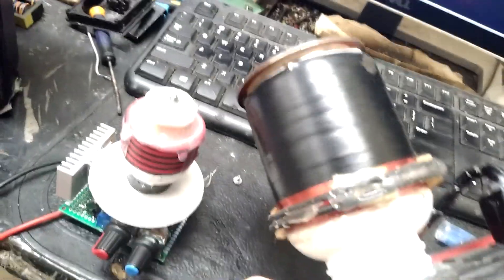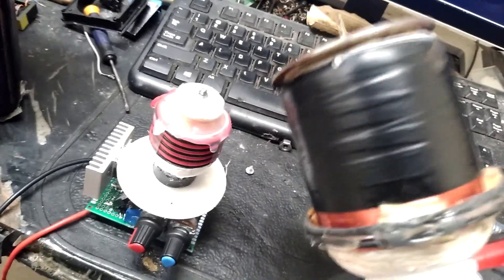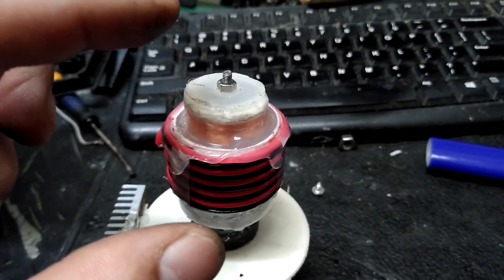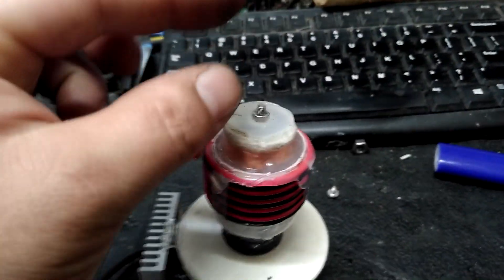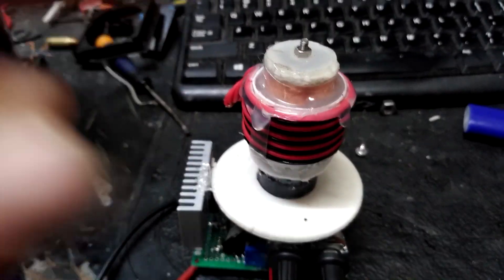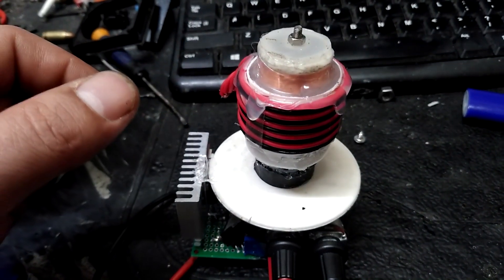You can see here's another coil comparison — these are my other ones that work pretty well from around the same voltage. I wouldn't make them anywhere near that big, but slightly scaling this up is where performance would really start popping, in my opinion. I noticed I had to run this from 24 volts to get even like a 1 inch little spark from this. Continuous, this thing will definitely eat itself up, even down to like 12 volts — it's going to pull way too much power.